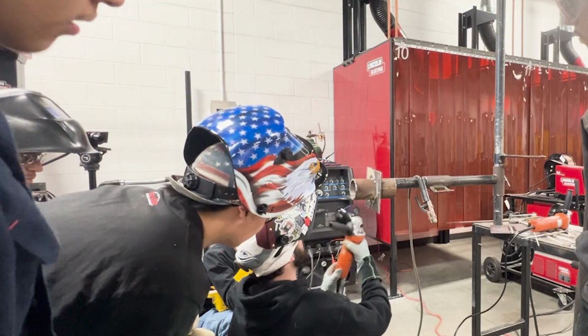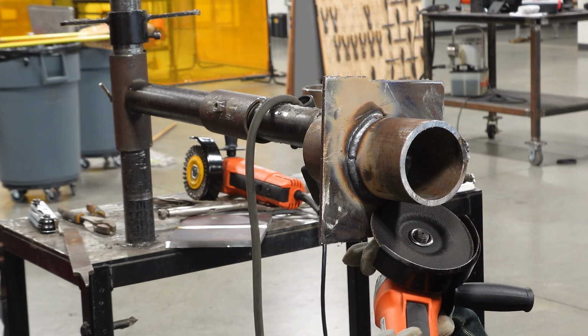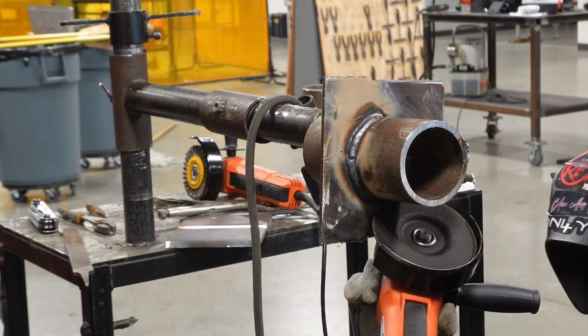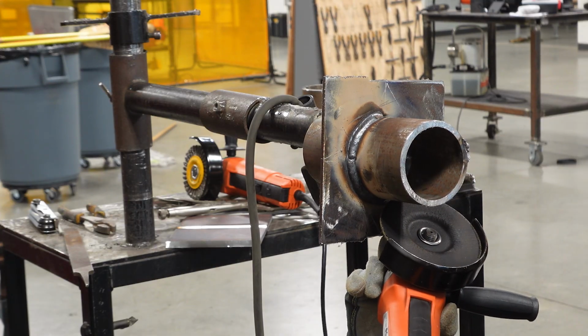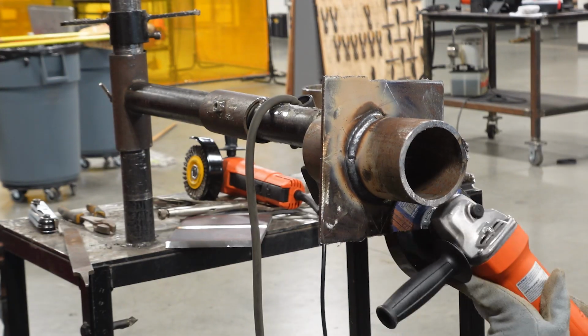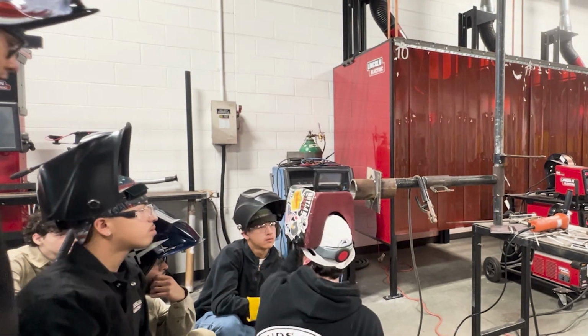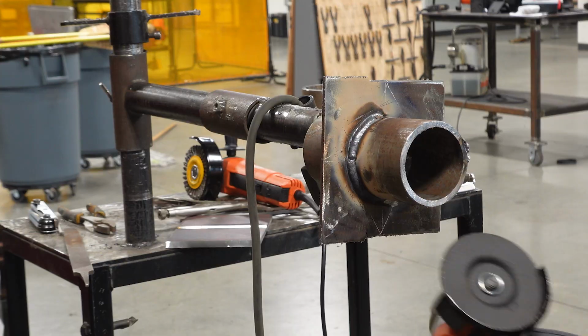You notice that I turned it over, okay? I can see everything I'm working on, okay? I can see it right over top of that disc, okay? That's how I almost grind all the time. I wanna see it. I look at this side, not this side. I see this side, I can't see nothing. Unless I'm like grinding like this, like on something flat. But if I'm trying to be precise, whoosh.